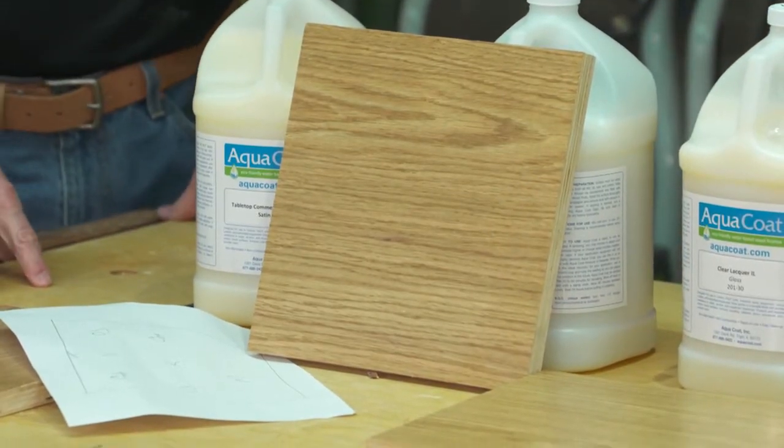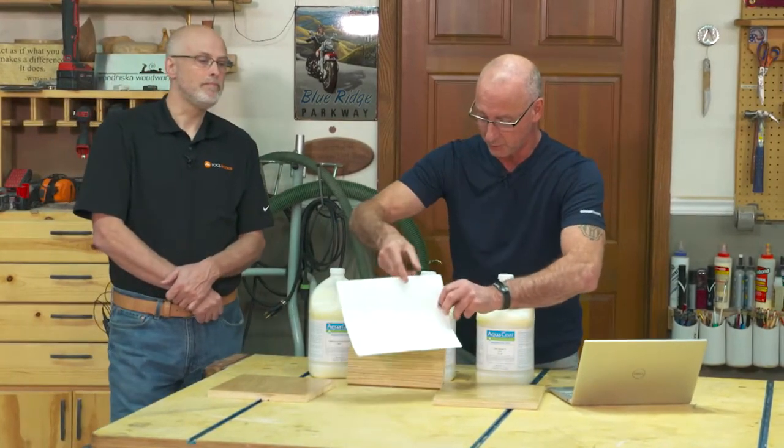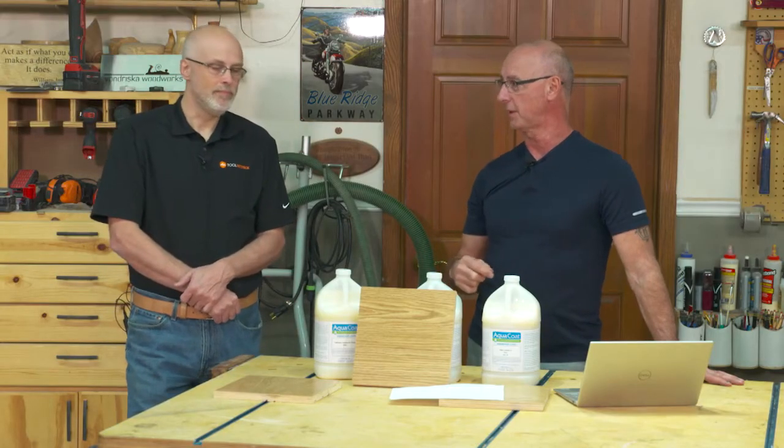So the Science Fair part of this — here's what I'm talking about. There is a test administered by the KCMA, Kitchen Cabinet Manufacturers Association, and that's why this sheet is here. This was my roadmap for the test. In this test, you put the worst possible stuff you could put on a finish: grain alcohol, orange juice, coffee — it's all described in the video that we're about to show you.